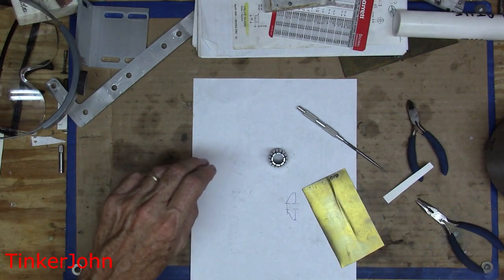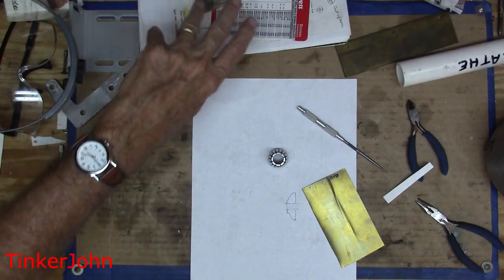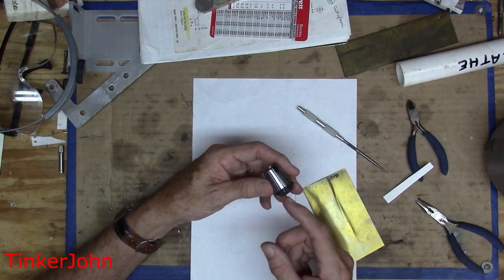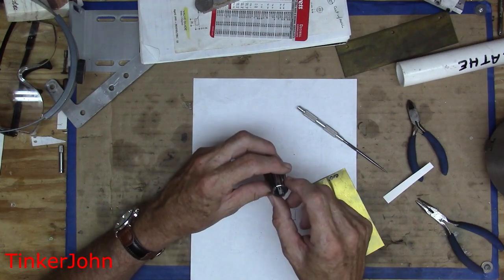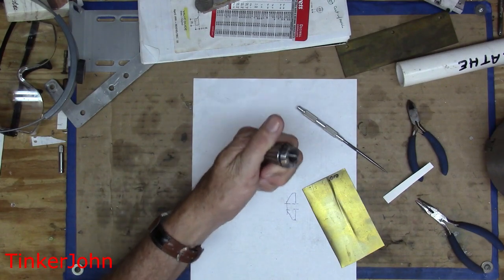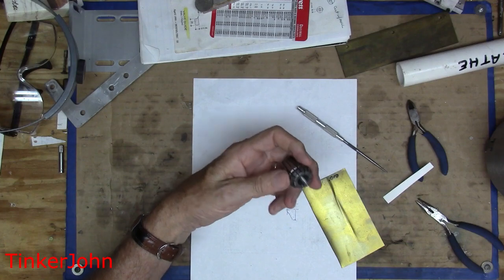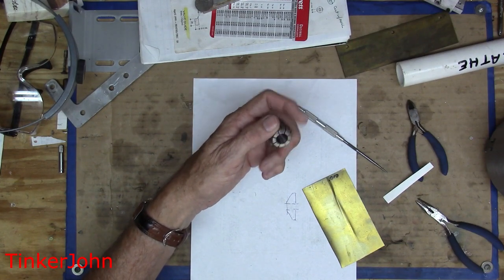After I got through with that, I took sandpaper and put each one of these in a vise, then came through and kind of undercut right there to make sure those edges were clean — and to no avail. So I think this is just a bad set of cheap collets. And that's where I am.